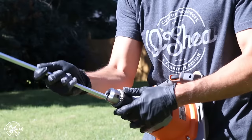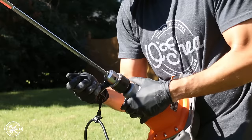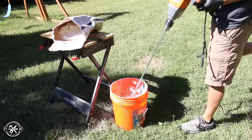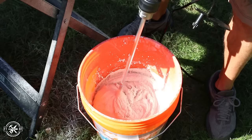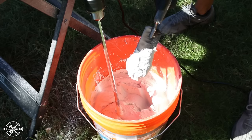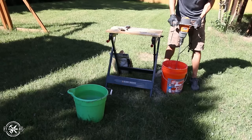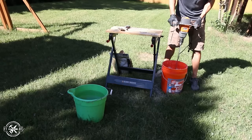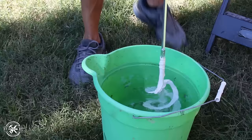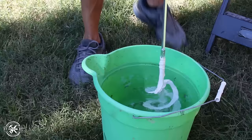For an OSB subfloor installation, it calls for modified mortar between the wood and the underside of the Ditra. I mixed up a batch of the mortar using the new Rigid mixer. This thing makes short work of mixing and it's got the power to do it versus a common drill, which you can easily burn up if you're mixing too much mortar and pushing it too hard. I got the mix to a thick milkshake consistency, then let it sit to slack and mixed it up again after 10 minutes. I probably could have gone a little wetter with the mix because it did stiffen up some after sitting. When you're done mixing the mortar, the quickest way to clean your paddle mixer is to put it in a bucket of clean water and run it at high speed — cleans it in a jiffy.